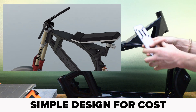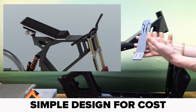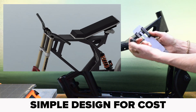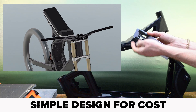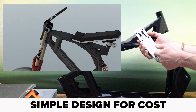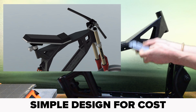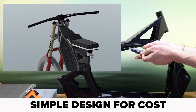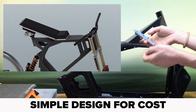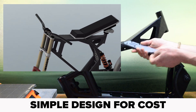I am looking into the cost and manufacture of these parts and I'll definitely be adapting the design based on what I find out. I think I can make a few of these components like this part here and the rails with polycarbonate on the 3D printer because that's incredibly strong, but I'm probably looking at some sort of aluminum maybe for the main piece. It's not a material I can fabricate though so lots to learn for sure. It seems to me that the toolpaths and cutting eat up a good deal of the cost so the better I can optimise this design the cheaper it's going to be.